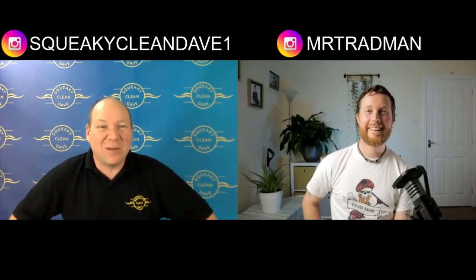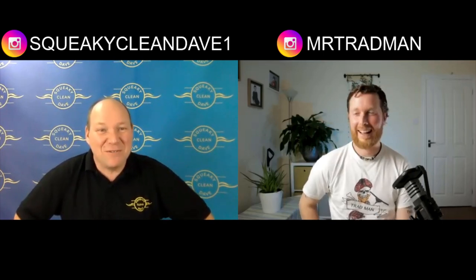Dave mentions having a large triple-extension ladder from his building trade days. As a one-man band, Pete's rule of thumb is to stick to a two-section ladder reaching about 20 feet when working alone. If going higher with a larger ladder, get somebody to spot and hold the ladder for extra safety. A two-stage ladder of up to about 24 rungs is a solid choice — Pete will link to the ladders he uses from Ramsey Ladders based in Scotland.